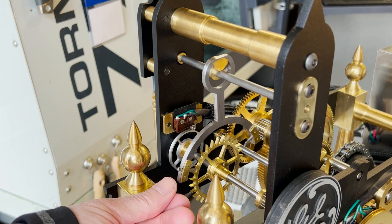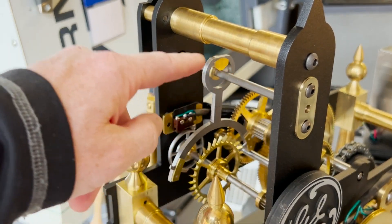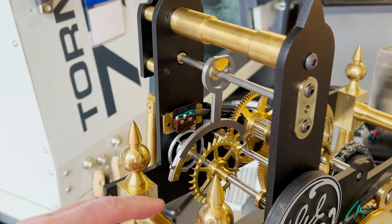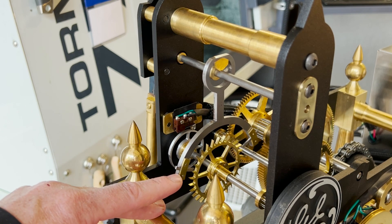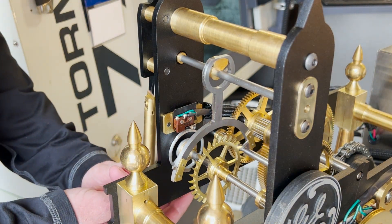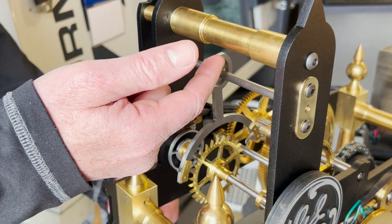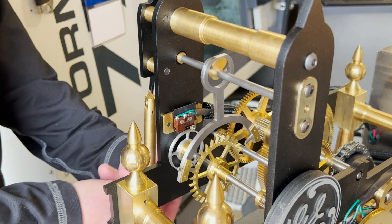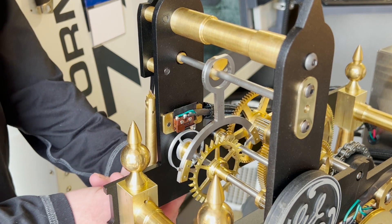You can see here — if I get in with this — what's different is it can decouple with those magnets. You saw me touch it, and it would stop and jump away. Right below there are the magnets. Some people looked at this and said it could be more dangerous, because if it ever got loose you could hit that wheel and cause damage. But I'll show you through abusive testing that there's no real way for this to get loose. On a standard clock this kind of work would cause damage. Now I can get real extreme — I'll dislocate that pallet and really overdrive this thing. You can see it rocking up top, over-traveling but then releasing itself, almost like a binding. This thing has been very safe. I've used it in my regulator and now on this tower clock, and it won't damage. Put it back in place with the pendulum and it's off to the races — it just works.